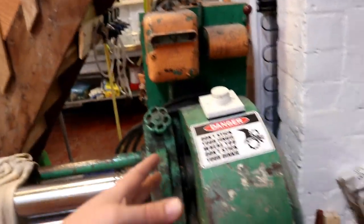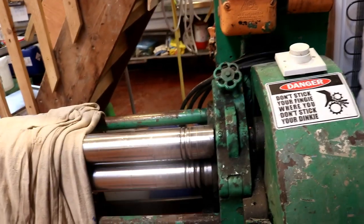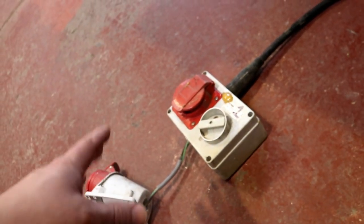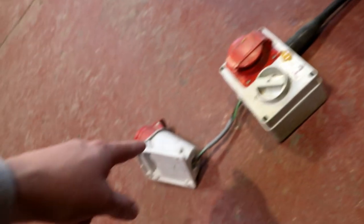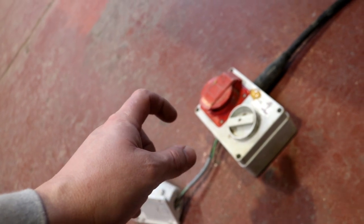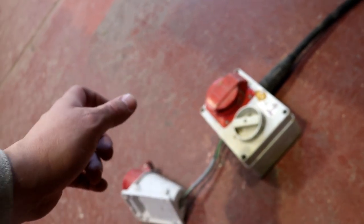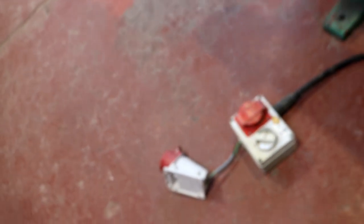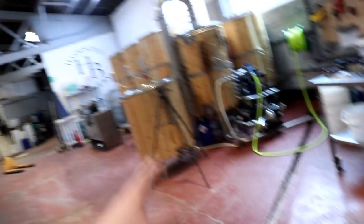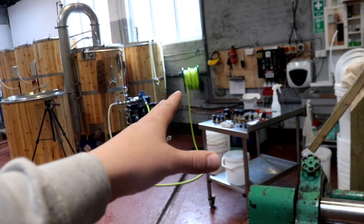On occasion when I've needed to, I have actually used it to power our three-phase rollers, but I'm not happy with the state of the cable. So what we're going to do is clean this up, make it look a lot neater, change this box out, get rid of this one, and also jump off one of the lines and the neutral to put a single-phase unit on the side as well so we can control or plug in the pilot kit.